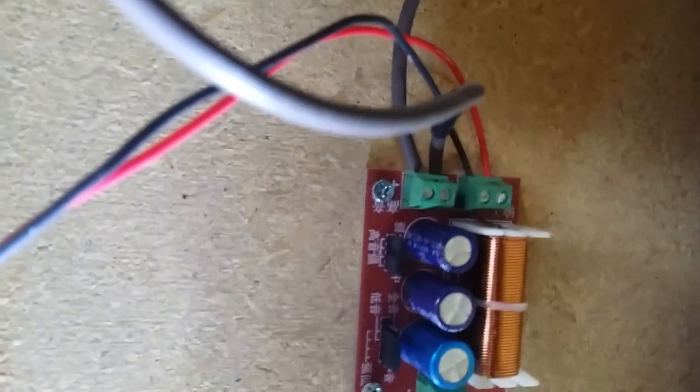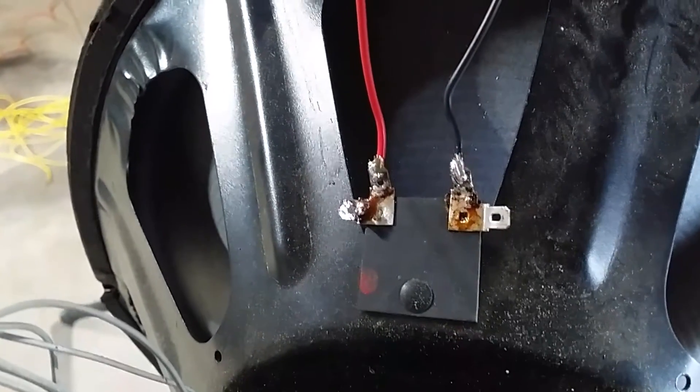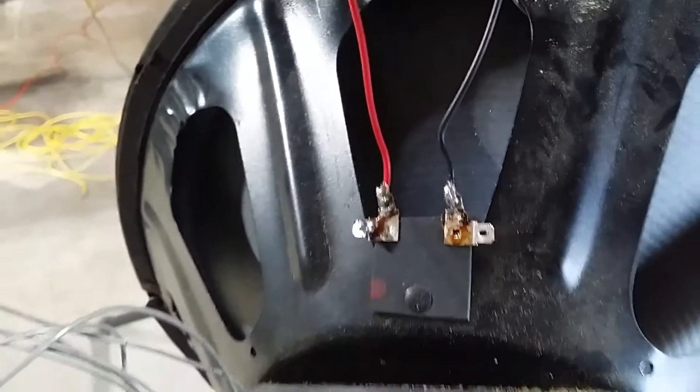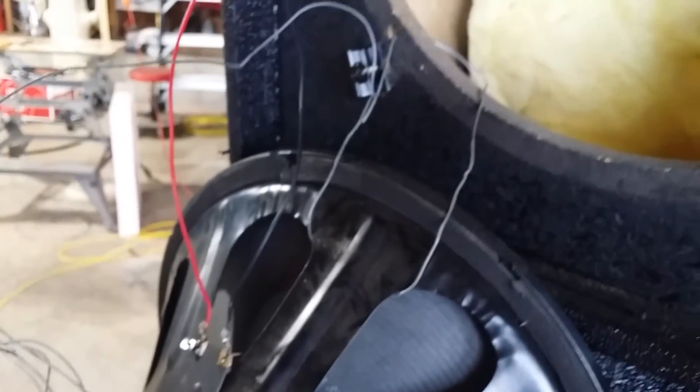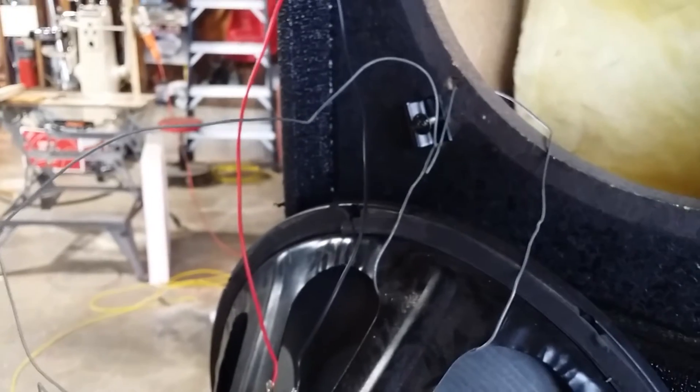It's really just that easy — cut everything apart, keep everything marked, mark your polarity. I marked the negatives with a piece of black tape so I didn't get anything confused. I had to add wires to the speaker; it had all kinds of junk soldered onto these things in the past, so I cleaned up those terminals a little bit while I had it apart. Make it a little easy for yourself and just hang the speaker on a wire so you can get everything wired together.